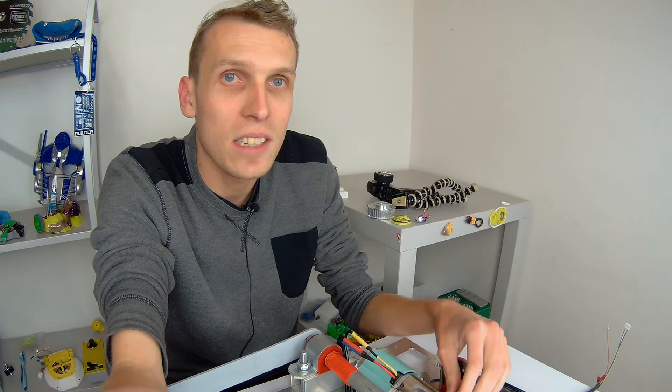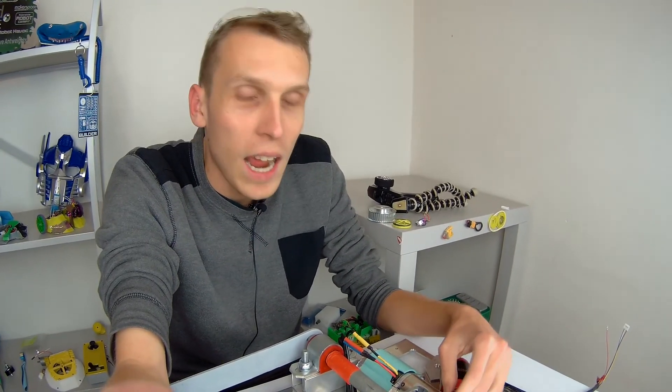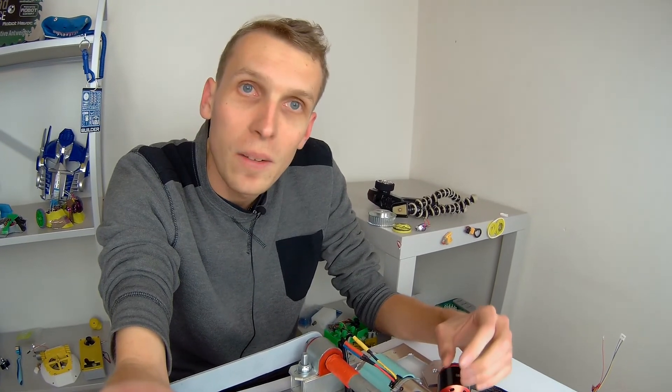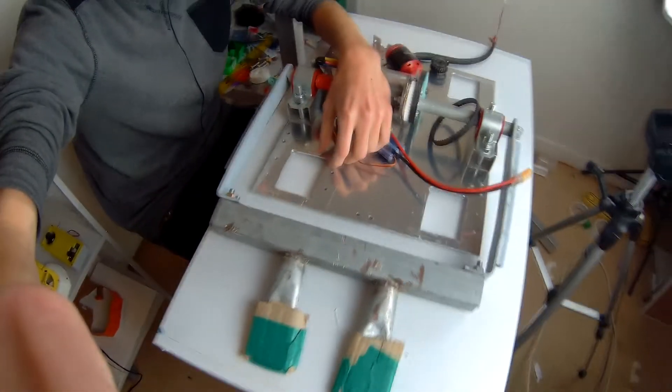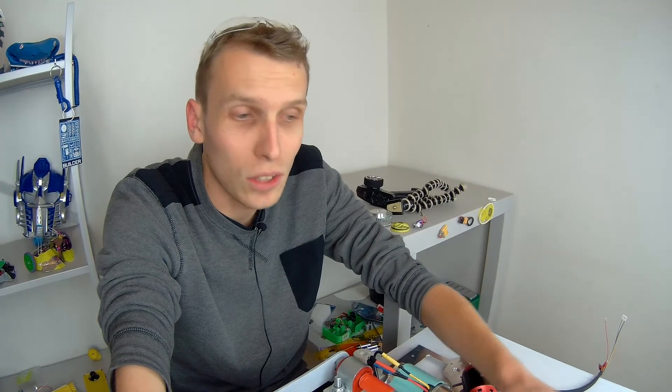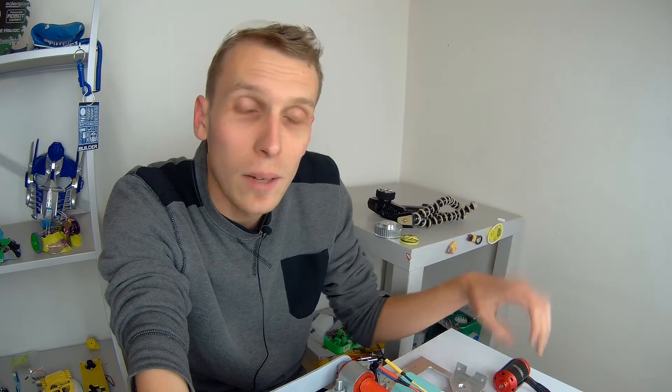I fixed that and then quickly tested it off camera with some load on it — and it destroyed the key way in the 3D printed pulley. There's just a lot of force involved trying to lift anything on the end of this arm, because it is a long, long arm. When you get to 13 kilos out there, it ends up being something like 300 kilogram centimetres of torque needed on this axle, which means the gear ratio and everything here is taking that amount of torque as well. I don't really have a way of fixing that right now, so basically we're going to move over to the hammer idea because I am right down to the wire.